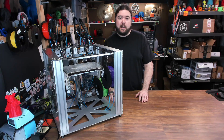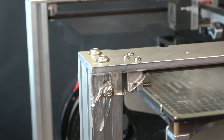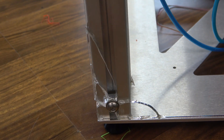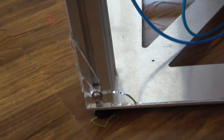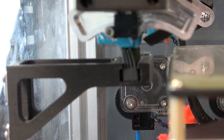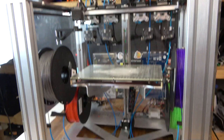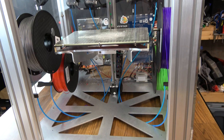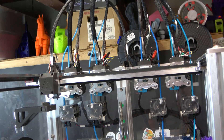There are a few other disappointments with the tool changer system. One of the biggest ones: almost every corner of the acrylic casing around the aluminum extrusion is broken. I know what you're thinking — I tightened those screws too much and cracked the acrylic — but I really didn't. These are all just hand tight; you can spin them off with your fingers. After moving the tool changer around a little bit, I noticed they started to crack, and I'm actually getting ready to start losing a few pieces. So there's definitely a better solution out there. Also, as far as the brush goes, over on the E3D forums a lot of people were using a silicone brush. I got one and cut it down, and it has been working pretty well so far. And the Bowden tube I ordered from E3D just wasn't quite the right tolerance for the filament I was using — it was just a bit too tight. So I switched out to all Capricorn, and that has seemed to correct a lot of issues with the extruder drives. Still somewhat sloppy, but definitely better.